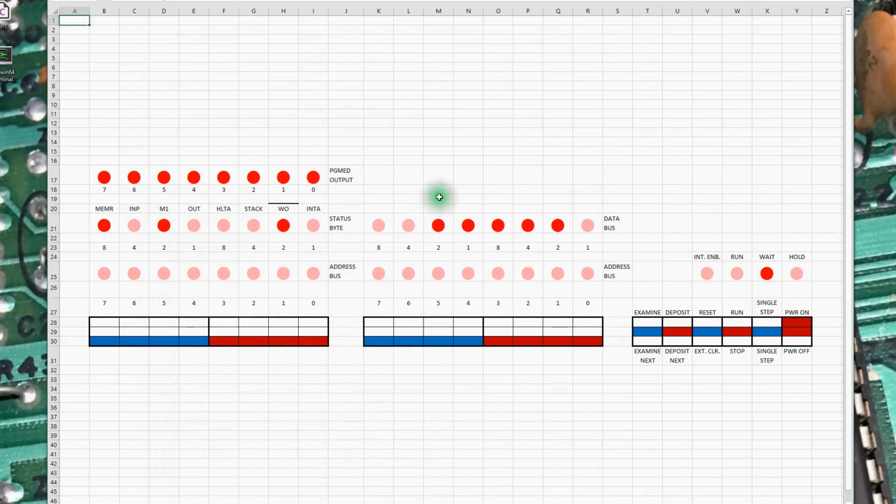So I think I've gotten through this pretty quick. Are there other things to really cover in this? I don't think so. Bit patterns in, reset the machine, run the program. What you'll see here is one lit LED walk across here, and then repeat the pattern. So it gives us something to play with. It gives us something to enter. So I think we'll move on here to actually bringing the machine up, looking at the actual physical front panel, and depositing that program into memory and running it.